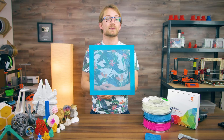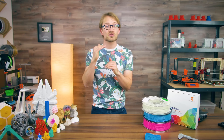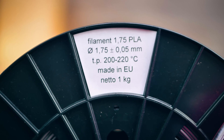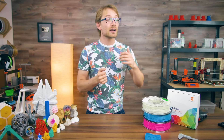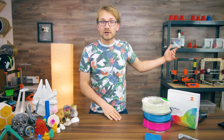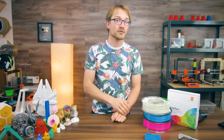Bowden setups actually help tremendously here. Here's how you can tune in PLA for the best results, starting with print temperature, which PLA is actually quite lenient about. Smack middle in the manufacturer's recommended temperature range is a good starting point, and while most PLAs will print well at just a standard 210 degrees Celsius, there are some significant differences between different grades. Some print best at 180 degrees Celsius, others can be easily pushed up to 230 degrees without any major downsides. Always keep in mind that no two temperature measurements between two printers are going to be identical — printers can easily have an offset of 10 degrees Celsius or more, even if they display the exact same temperature, so what works for another user doesn't necessarily have to work for you.